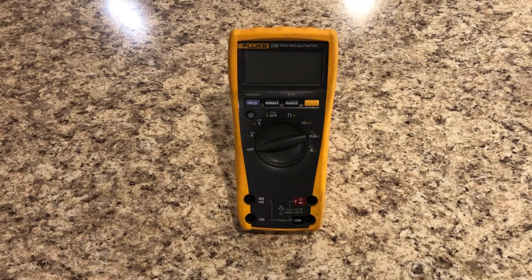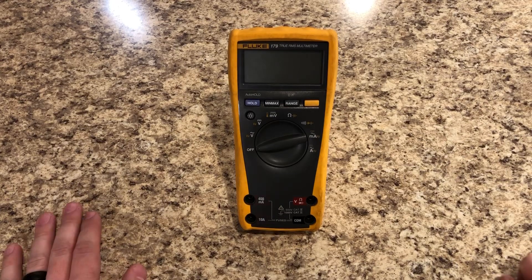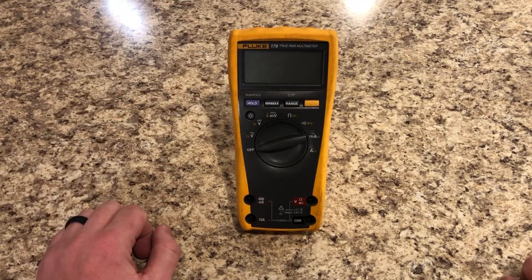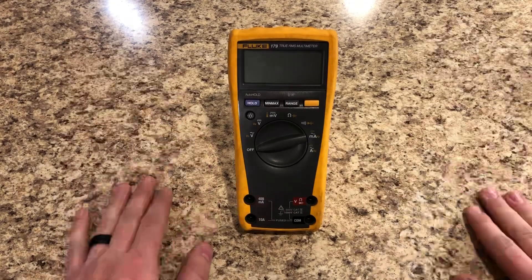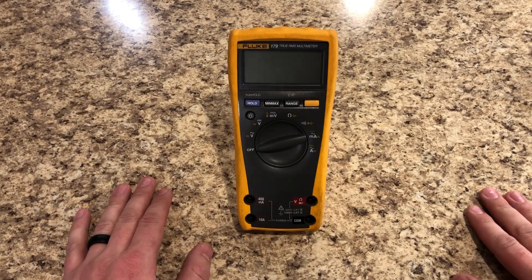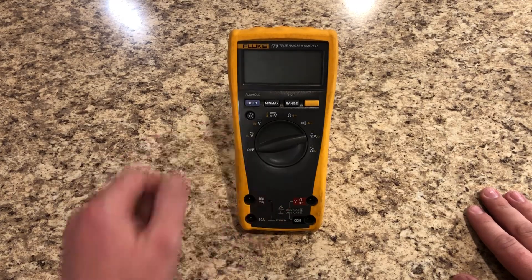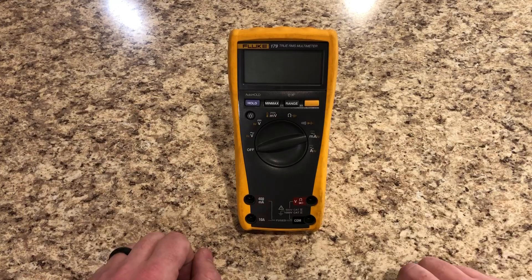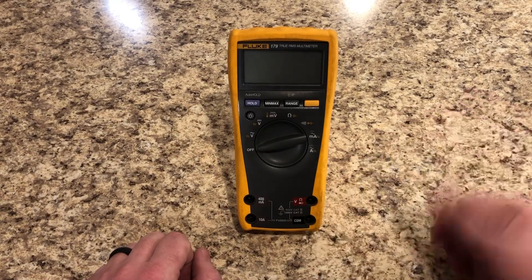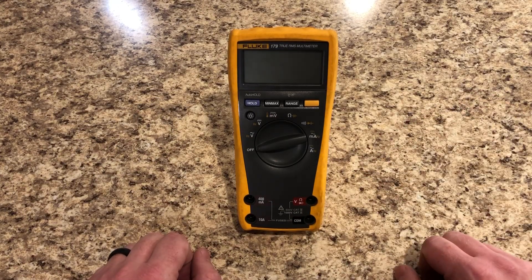It's been a little while since I've added any new videos. Got a little bit of a cold right now but we're going to work through this. I've got a Fluke 179 and the milliamp function suddenly stopped working. What happened is I was checking milliamp circuitry on a control circuit for a VFD, forgot to swap my meter leads around, forgot to change my toggle switch over, then went right to checking some line voltage and popped the fuse.